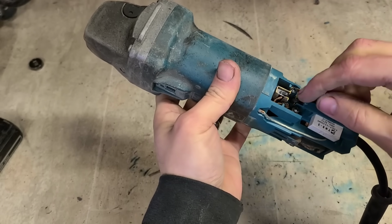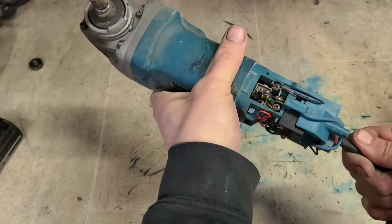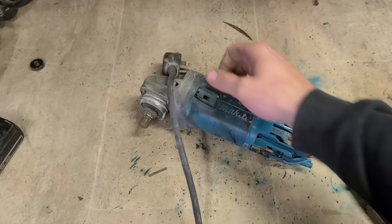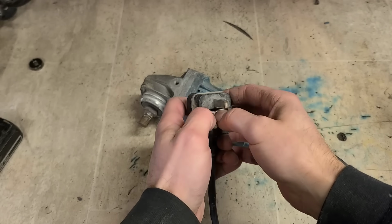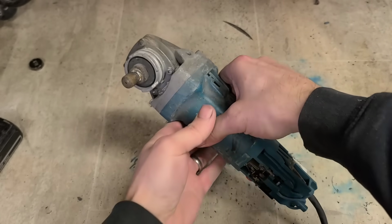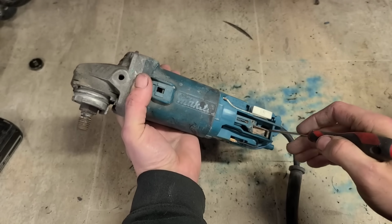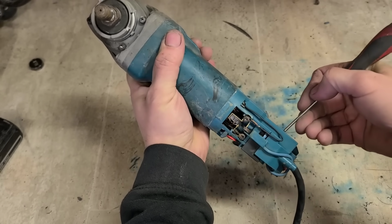Doesn't look bad. The brushes are in place. Check the lead. Or we'll just check the fuse, which is missing. I always go for leads and brushes first, and never think to check a fuse. Let's try it again this time. Put a spark in there.